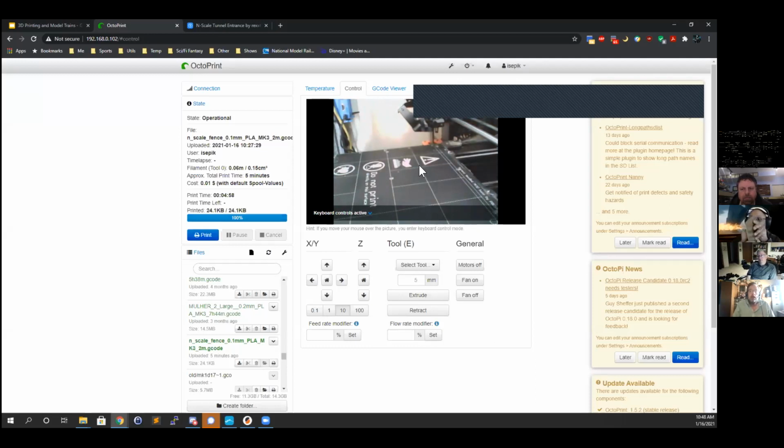I can bend it. It's right in front of my face here. You can see that I can bend it, but it's strong spring steel, and it's coated on both sides, so I can flip it over. Basically, if I have a big print that has some height to it, when I'm done printing, I take this whole bed off and simply do that, and one side of it pops free, and I can just pull the whole thing off. It makes it much easier to get the prints off.